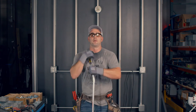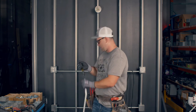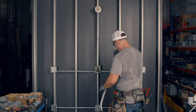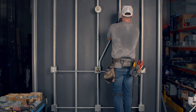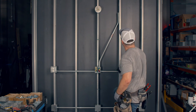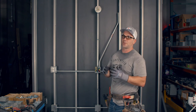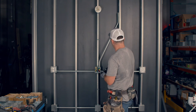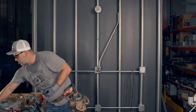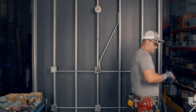I need to find a different place to put that reamer — I'm having to cross draw. If this was a Western, I'd be dead. So pop that in there — it's going to go right there, box going up top. One thing I want to note: when you're running conduit, you have to have a strap within three foot of the box wherever structurally sound. If you use an unbroken stick of pipe, you can go up to five feet where it's not structurally feasible. Three foot from a box is usually doable.